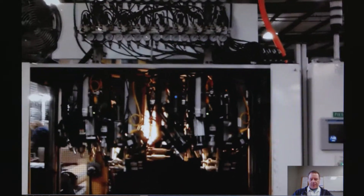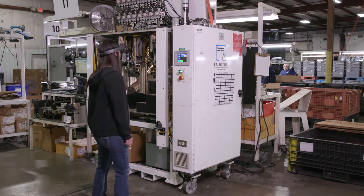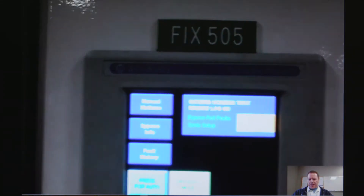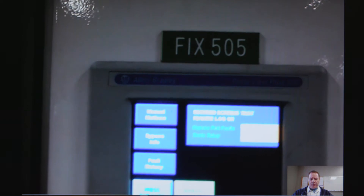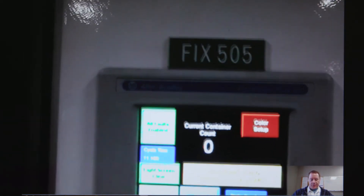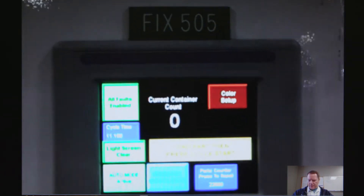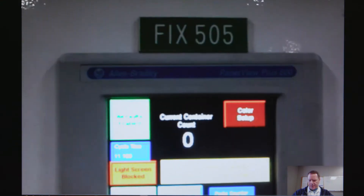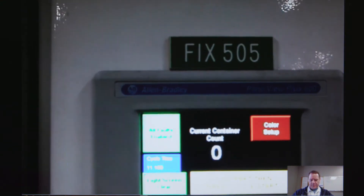First, let's take a look at the control screen. Let's put it in auto mode so we can check the safety curtain — we'll make sure the safety lights aren't interrupted, or it's at least working correctly. So we're good. Put your hand in front of there — yeah — and move it out. That's working just fine.